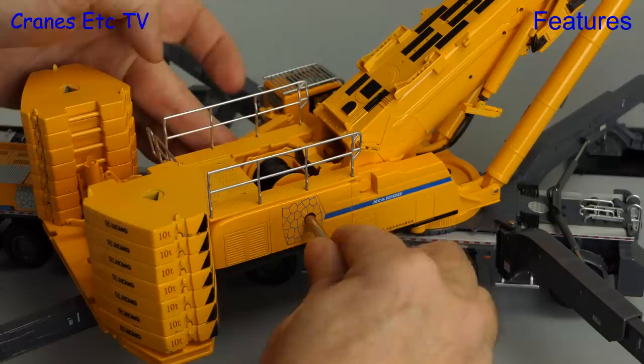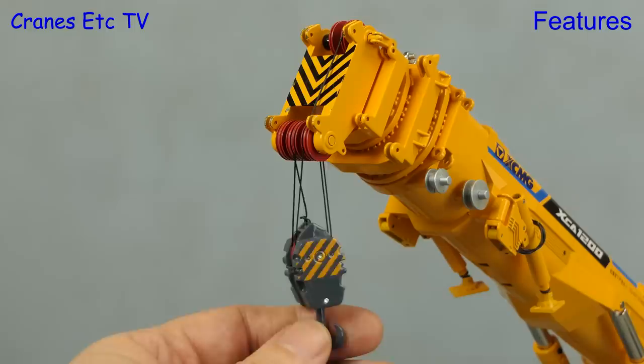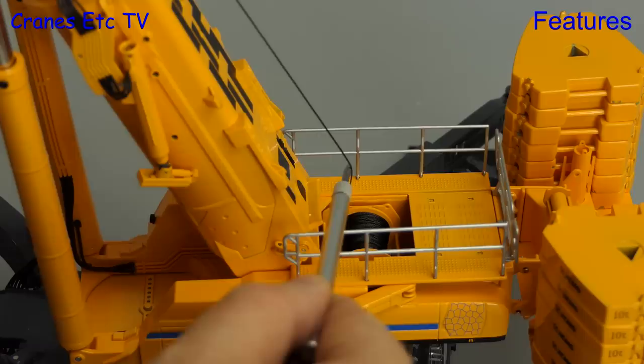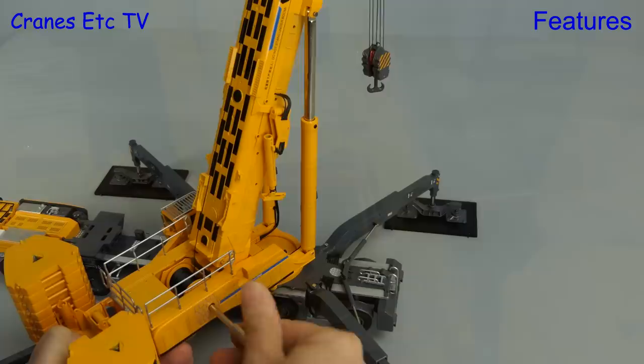To get hooked up we take some rope off the winch drum and run it over the top of the boom. There's a choice of a very large hook block or the smaller one. One odd thing is that the rope on the drum appears to be wound the wrong way, but that could be unwound and corrected. The winch drum is well engineered — you can insert a key and push against the spring, giving the winch drum a positive brake action so you could hang a decent load from the hook.